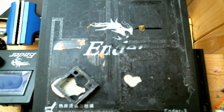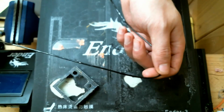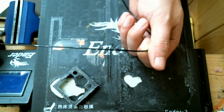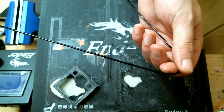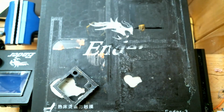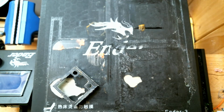The main thing I want to bring up with these filaments, another important point, is, as you can see, whippy, all that stuff, but that's generally very consistent looking. You don't see really any diameter shifts or changes. Now, someone's going to probably say, well, why does that really matter? Who really cares? Why is that so dang important? If you're saying that, you probably have never dealt with something where the diameter was not consistent. Now, if it's consistent but slightly low, you would have a lower weight, you would have less issues, but when it's bigger or thicker, that's when you get the real problems.